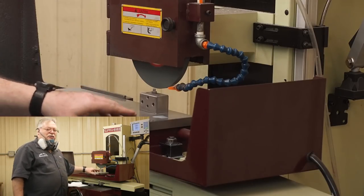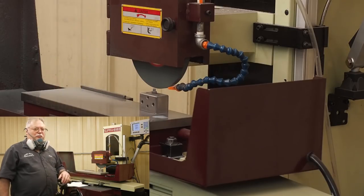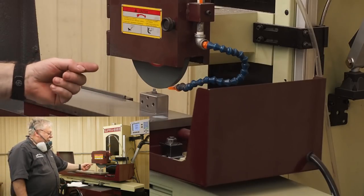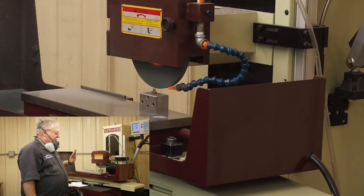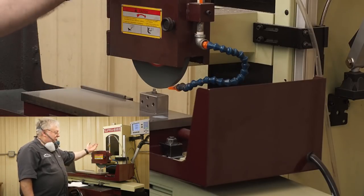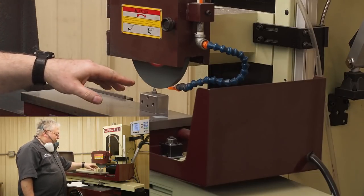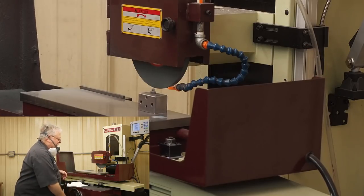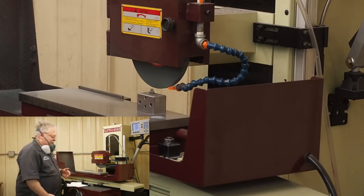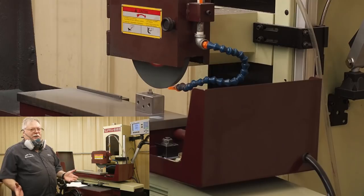But one thing, I was talking to Seth on the phone the other day and told him I would try to give some pointers on the dressing. I could hear when I'm grinding with this diamond that it sounds better as I'm going that direction. When I come back this way, it sounds louder. Now, when I'm rough dressing on this, I go ahead and take off stock, probably a couple thou at a time, and then I use a pretty fast traverse because I'm just roughing it out.